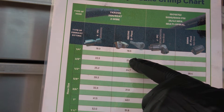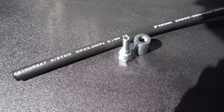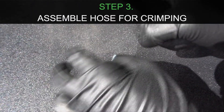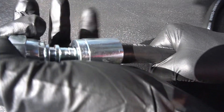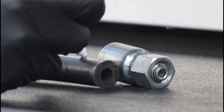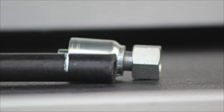In this demonstration this gives us a crimp spec of 21.3. You're now ready to assemble the hose for crimping. First place the ferrule over the hose and then insert the hose tail, making sure the collar of the ferrule aligns with the groove in the fitting. You may need to use silicone. When using one-piece fittings make sure you line the fitting up next to the hose and mark where the fitting should come to when pushed all the way home.